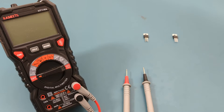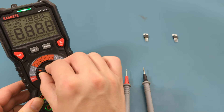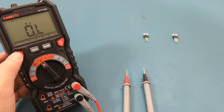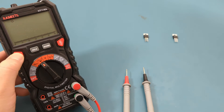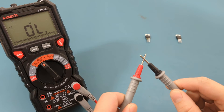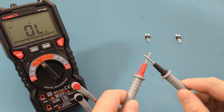To check if a voltage regulator is bad, check if there is a short circuit. On the multimeter, turn the dial to the resistance and continuity settings. Press the function button to toggle to continuity mode. Before starting, touch the probes together to make sure you hear a beep. Since we hear a beep, there is continuity and the multimeter is good.